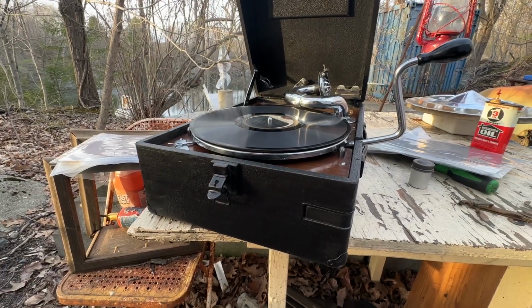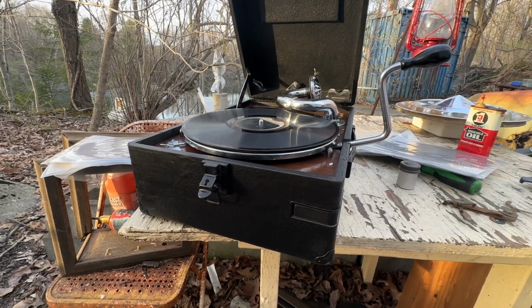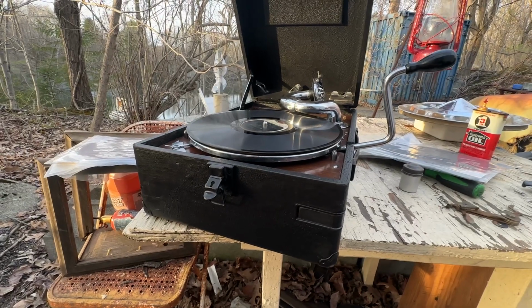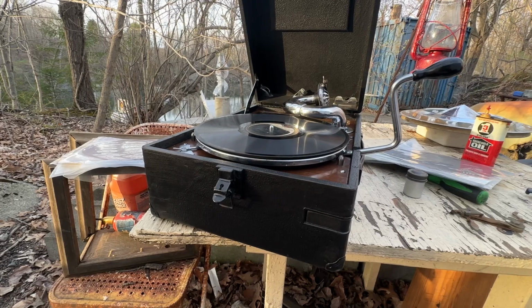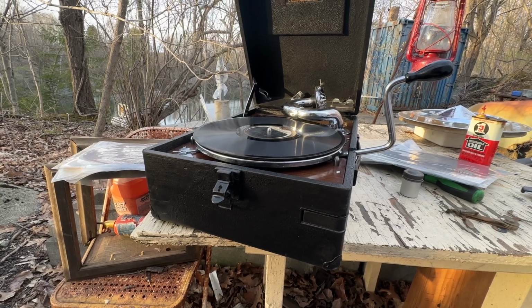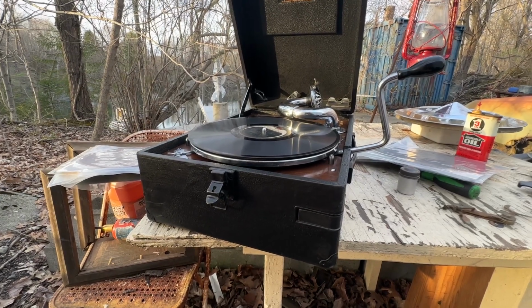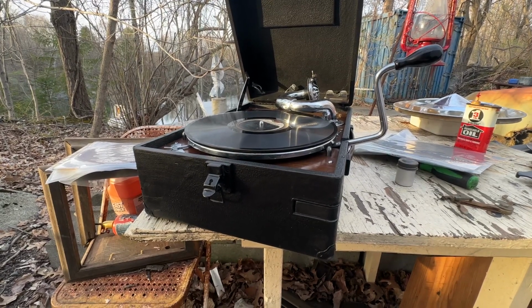Now, I looked at it, looked close, and found out somebody had oiled it. I don't know why that would be done. It can't have oil on it. So I got the clip off without breaking it, wiped down the spindle and the part of the turntable, any trace of oil on there, and the clip itself, reinstalled it, put the record on, and I think I've played 10 in a row now, and it's actually working fine.